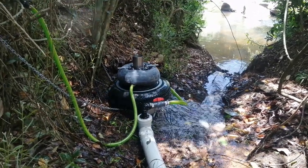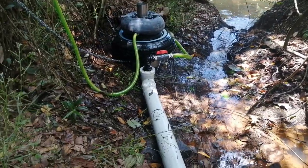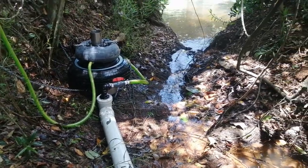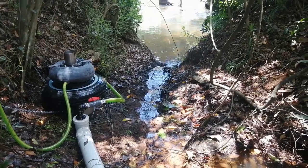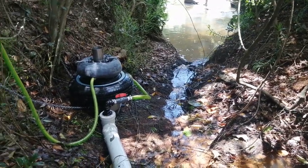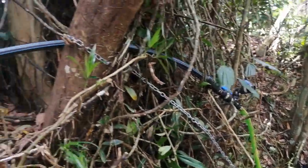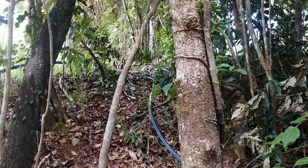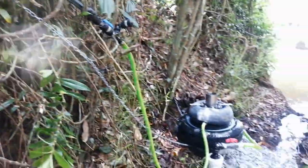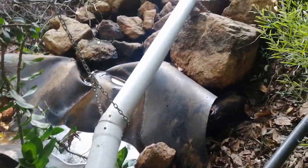This is a TA-13 pump with a 98mm piston, taking the water out of the supply pipe. It's running on a little stream that runs into the Beatrice on the Athlon Toverlands near Miller Miller. That's the delivery line and we're only pumping up to about a 13-14 metre head. We're working off 0.9 of a metre, or probably closer to 1.04 metres.